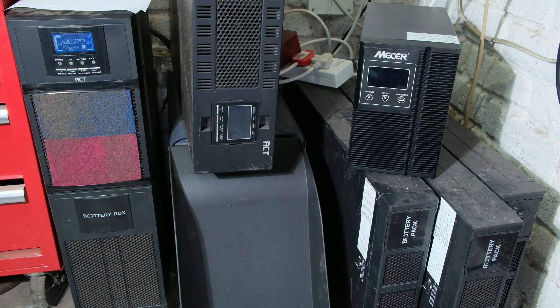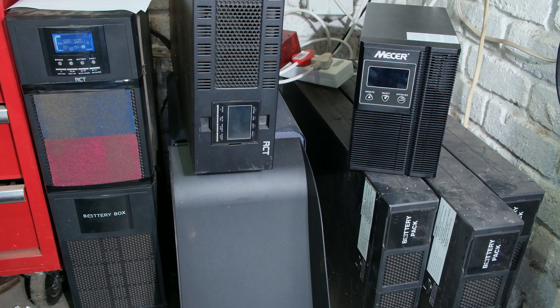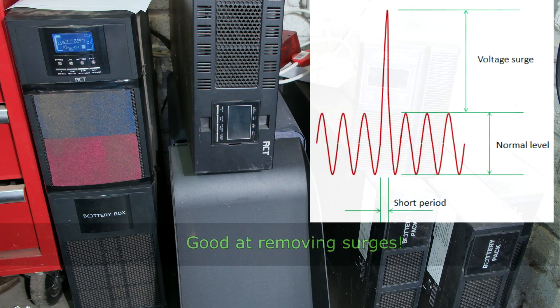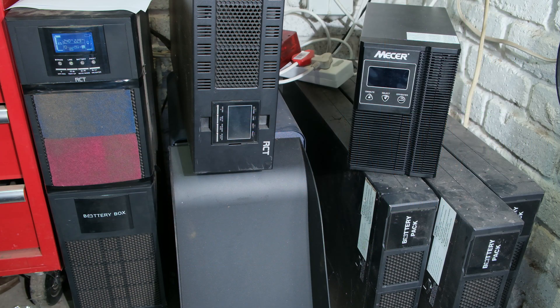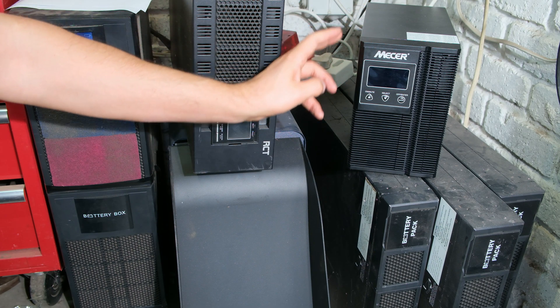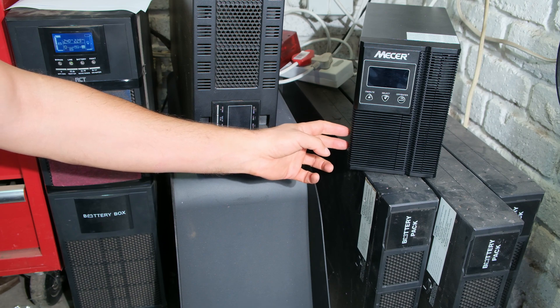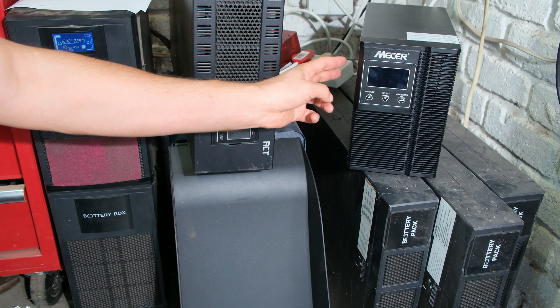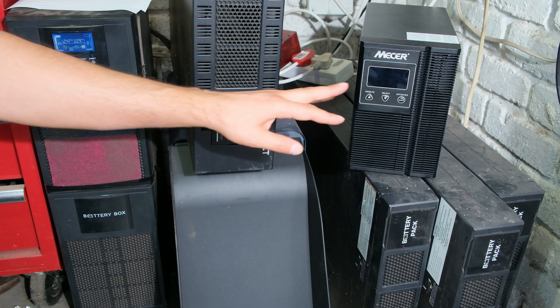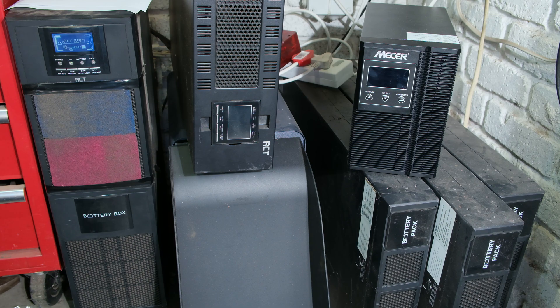There's a different battery management system required for lead versus lithium. So if you're looking for a backup power solution, you might want to think twice about these products unless you're specifically looking for something that stops surges. One of the problems with load shedding is when the power comes back on, there's often a surge that can easily destroy motherboards and computers. A little UPS like this is extremely useful because when power comes back on, it will only generate a clean output after full conversion. For protecting sensitive electronics, these are great. But as a backup power solution, they are not great.